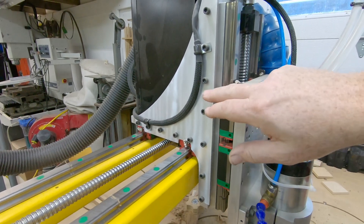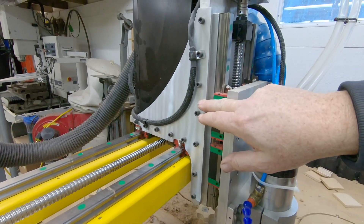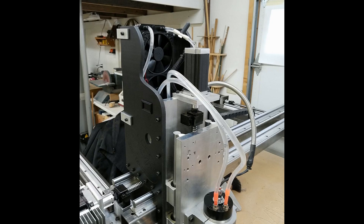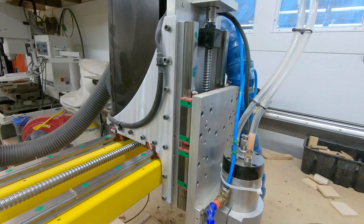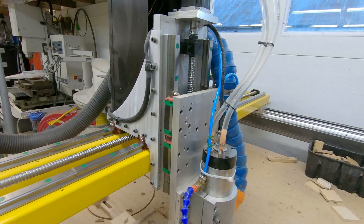While we're up here, you can see the aluminum gussets on the side of the X-axis carriage — yes, those are version 3. When I first made the machine they were plywood, and those really worked super. I should have left them there. I then switched to some expanded PVC which was not as rigid, so when I got rid of those I went right to aluminum. And yes, I made those on this machine.